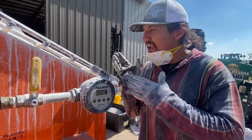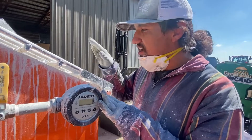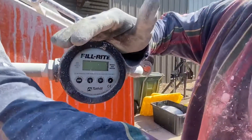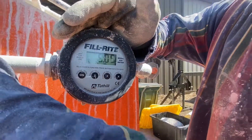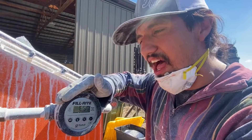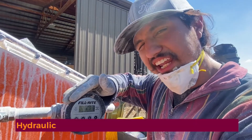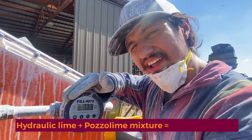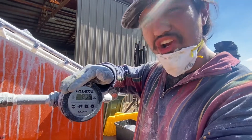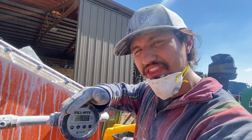Now that we have a good mix of the binders and the hemp fiber, you come back and add 5 more gallons of additional water to really help the lime and the pozzolanic mix adhere to the hemp. That is what will create your hempcrete mix, or your cast-in-place hempcrete mix.